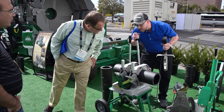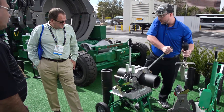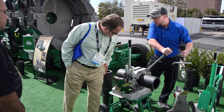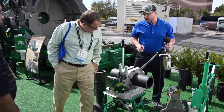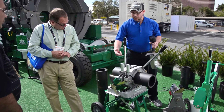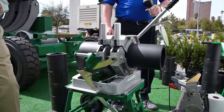Both ends look flat and glass-like. I'm going to apply pressure until both of the beads roll over and touch the ends of the pipe. With my cam lock engaged, I can release the pressure and my cam lock is going to hold the pressure on that. Now we're going to let the pipe cool under pressure for 11 minutes per inch of wall thickness.